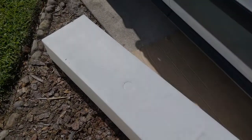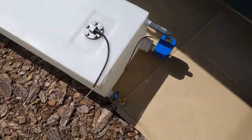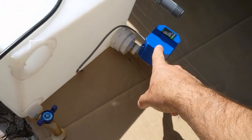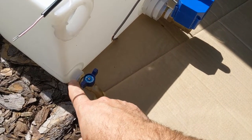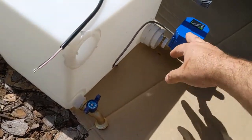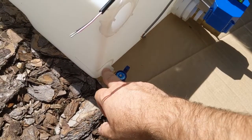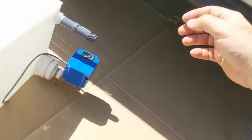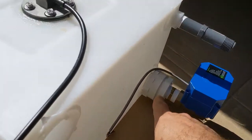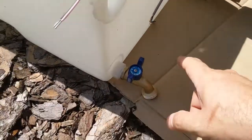Hey guys, so we're about to fit the rubber grommet here, and I'm gonna show you the best way to get this right the first time. And if you're looking at my front end pieces here, you can see that I reconfigured it. This is a 3/4 inch ball valve, but it's a 1/2 inch hole, so it would be constricting to put this on this side. Also, because it's so close to the wall right here, you can't untwist it if it ever breaks. So I decided to get a 3/4 inch adapter to a brass fitting, 3/4 to the ball valve, and then I just put a spigot